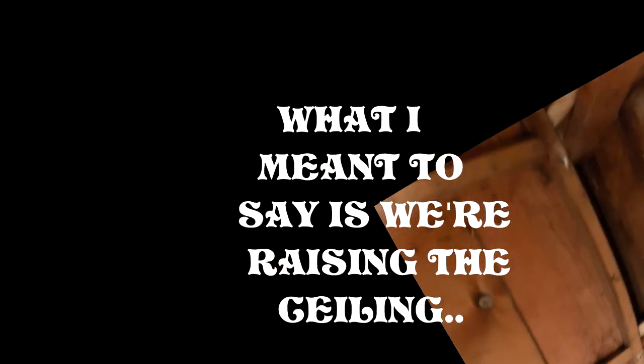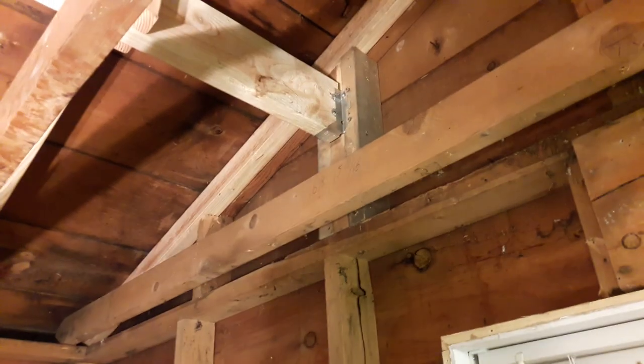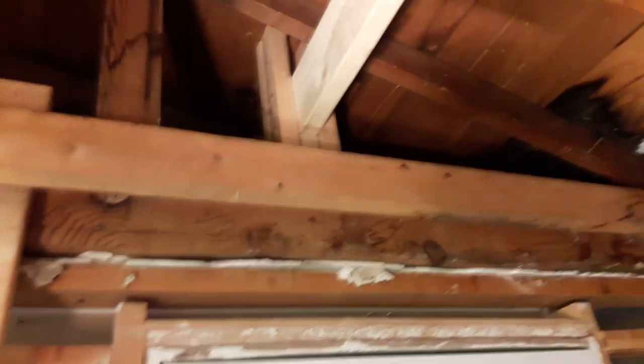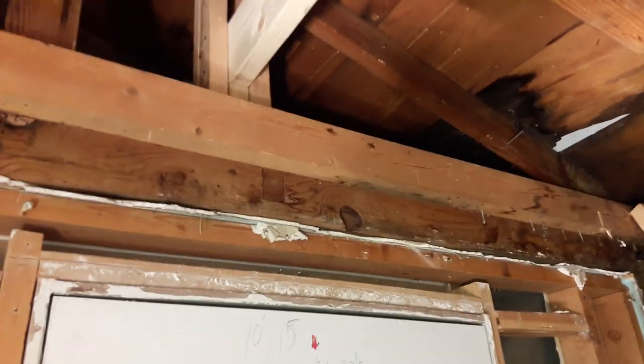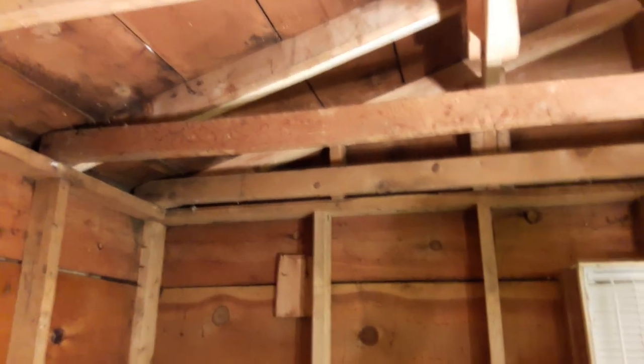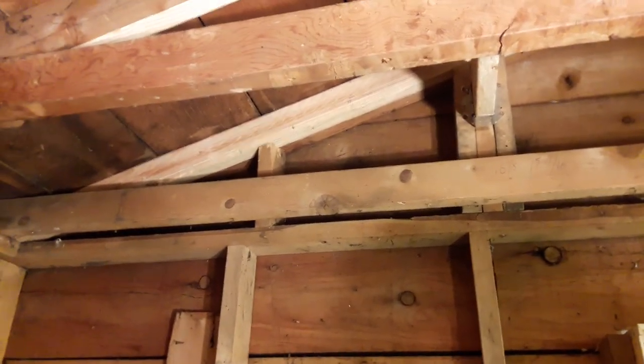All right, we're raising the roof is what we're doing, and we've got the first beam in there, and we've got it stabilized over there, and over there. I had to build a little slot brace. It's connected to the main beam going across there. Anyway, that's 8'1" high. And we're going to be going 2 foot to center. I got them marked over there. We'll put some supports in.